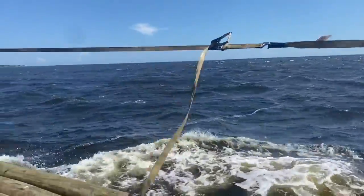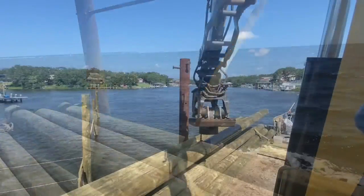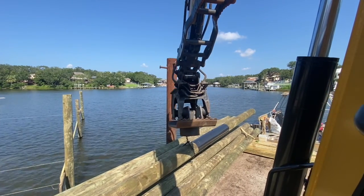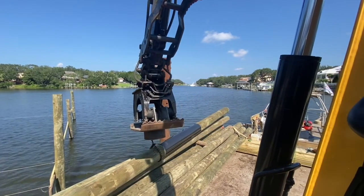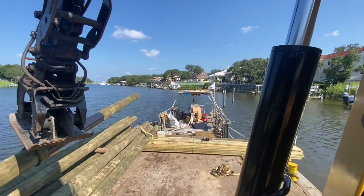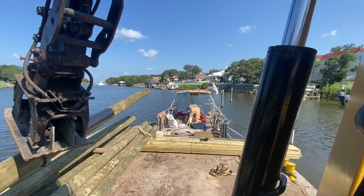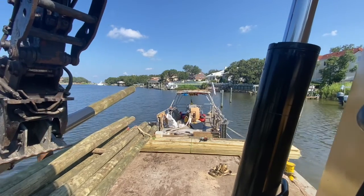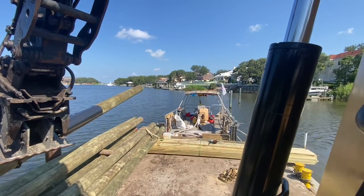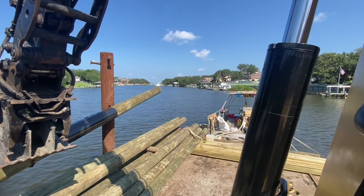Not every day is a smooth day out here on the bay. This is a 9-inch tip, 30-foot long piling. A 9-inch tip means the smallest part of this piling is 9 inches — probably got about a 12- to 14-inch butt on it. We're setting this piling for the jet ski lifts. I always go with a large piling, especially in muddy conditions, because I don't want the jet ski to pull the piling over after we get the weighted jet ski on the piling.